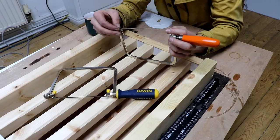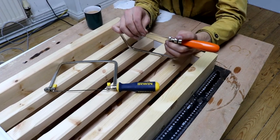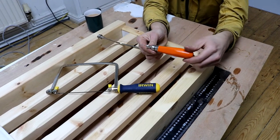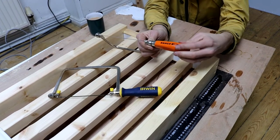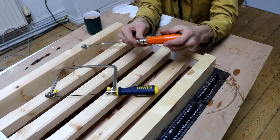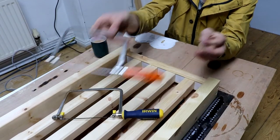Position your blade in the slot like that. Make sure it's connected in at one end, then position your blade in at the other end. Support it to stop your blade twisting, and then just slowly twist the handle to increase the tension on the blade. Once you meet a bit of resistance, it's actually locked against itself so it won't go any tighter — there's no point over-tightening it.